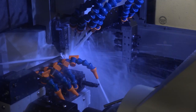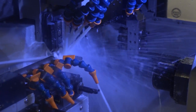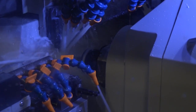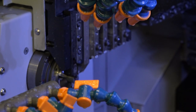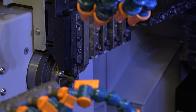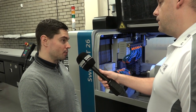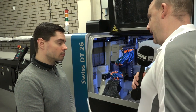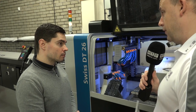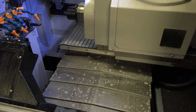The way this machine is configured — the back working and front working — means you can optimise your machining processes, and with driven tools you can manoeuvre them around the machine to do milling on both the front and back end. That's correct — it's modular, so any of the live tool stations are interchangeable. The counter spindle can work completely on its own whilst the main spindle is making another part. Whatever the complexity, you can balance front-end and back-end turning to get cycle times to a minimum. We very rarely have a cycle time of more than one minute — mostly sub 40 seconds.